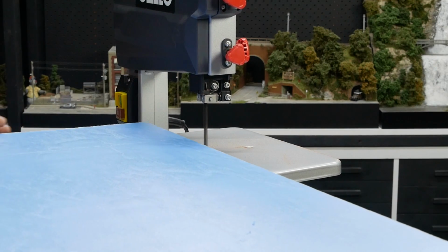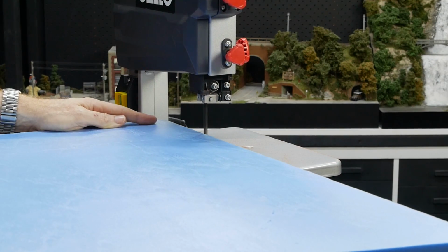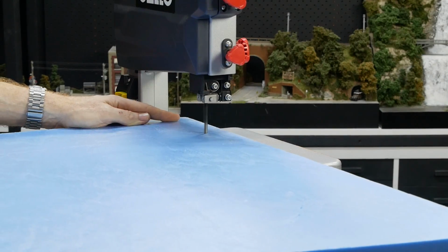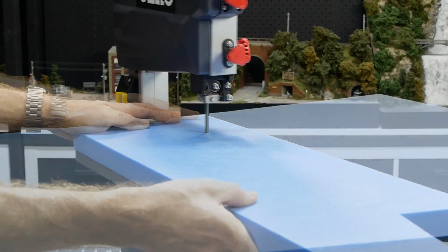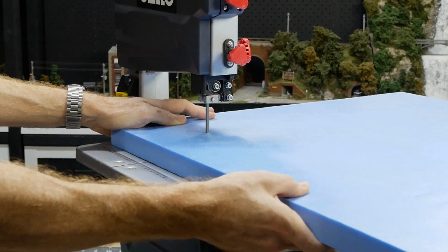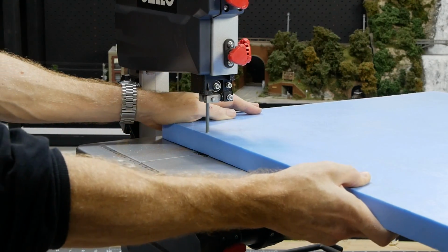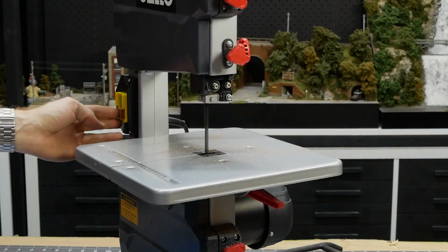The best method for me was a small bandsaw. This was fast and accurate, plus it can do curves with ease. The main downside is the dust. Small foam particles go everywhere, so it would be wise to wear a mask and be prepared to spend some time cleaning up. Plus, the edge isn't as sharp and clean, but for what I'm doing, that's not a problem.